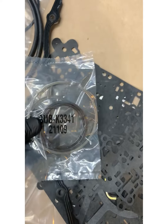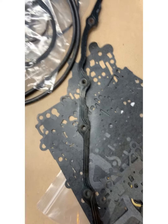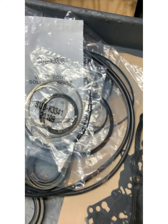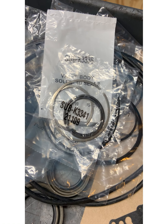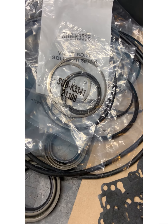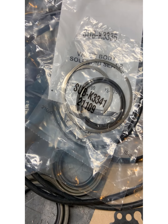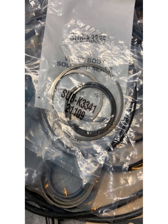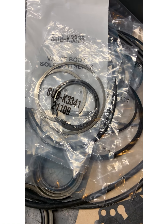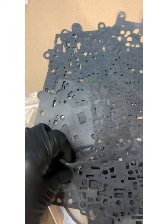Here they're giving me some new snap rings, and this is good — usually you can reuse these, but if they're going to give you nice new ones, the tensile strength is going to be at its max. They won't be stretched from forcefully removing and reinstalling. Of course I am very careful and use a good snap press or arbor press to remove and reinstall the retaining rings without damaging them.